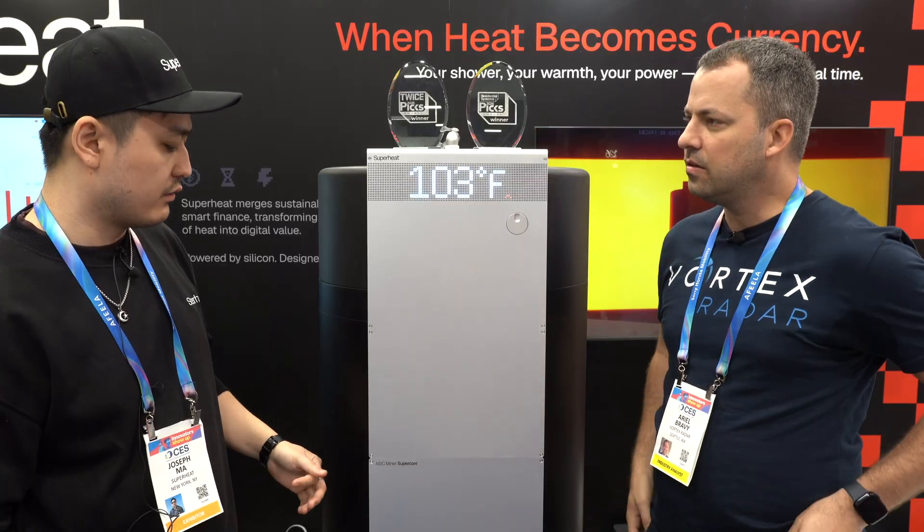How long does it take to heat up the water and get it up to temp? So this is a 50-gallon tank, and from tap cold to 140 degrees it's around two hours. And I understand you've also got the ability to preheat the water ahead of time so as soon as you turn on the shower it's hot. In software, what we really worked on is a smart mode where it takes around two weeks to learn your water usage habits — so it knows, for example, that you shower at night, and it'll learn to heat up the water in the evening while you're eating dinner.